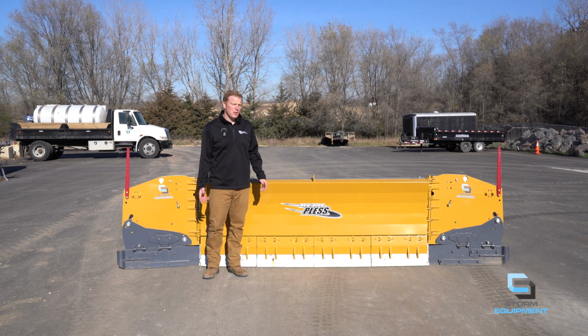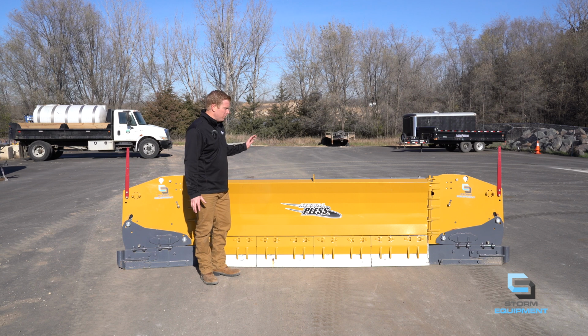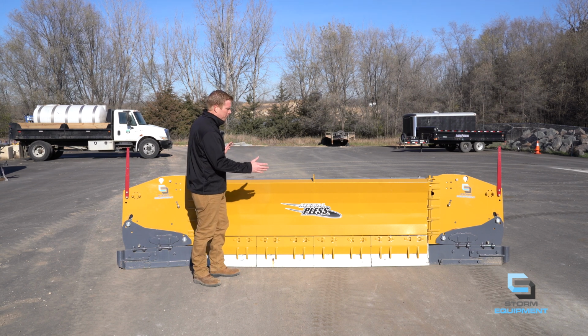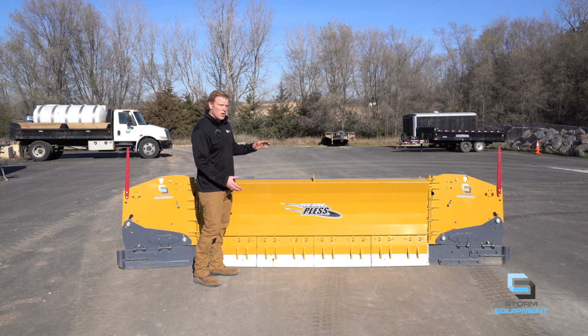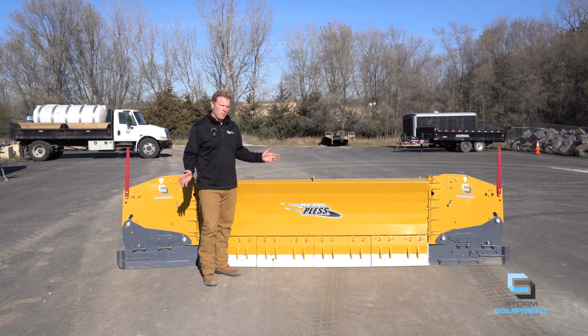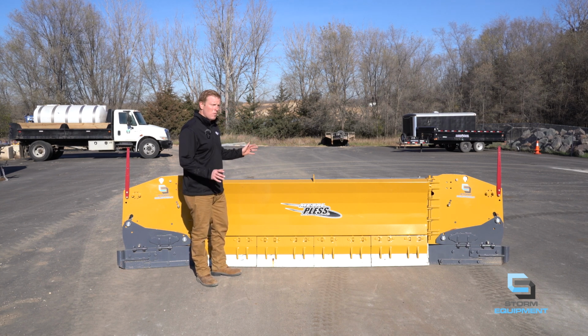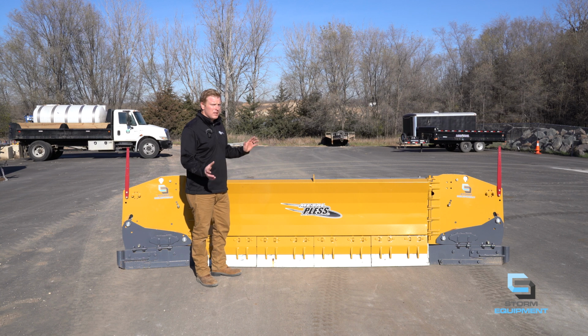In today's video, we are going over the Agrimaxx 083013. Let's take a look. For this Agrimaxx 83013 Live Edge, you have an 8-foot moldboard, 30 inches tall, and two 2.5-foot wings. For an 83013, you usually want to see 8,500 to 10,000 pounds of tractor behind this. Traction is key. Once again, horsepower is important, but we really want to focus on the weight.